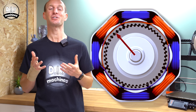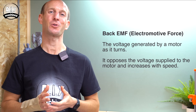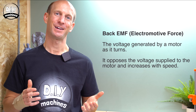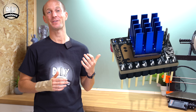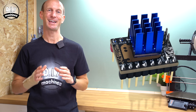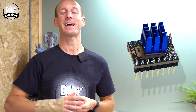When the stator's coils are energized, the rotor rotates step by step — hence the term stepper motor — and locks itself into the position of each of the new changing magnetic fields. Stepper motors generate back EMF as they move. Back EMF is simply a voltage produced when the rotor moves through the motor's magnetic fields. The faster the rotor moves through these fields, the more back EMF is generated. Some motor drivers, such as the TMC2209 we're using for this demonstration, have internal sensing circuitry that can monitor this back EMF, helping to estimate load on the motor or detect a stalling condition.